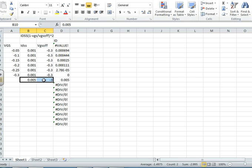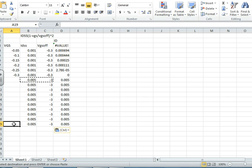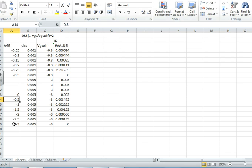That's what's going on. There's a question on the next test. You're going to have to do it. You don't have a choice. Okay, so we're going to go minus 3, minus 2.5, minus 2, minus 1.5, minus 1, minus 0.5. All right, and we'll go to 0. Now we have all the data we need for our transconductance curves.